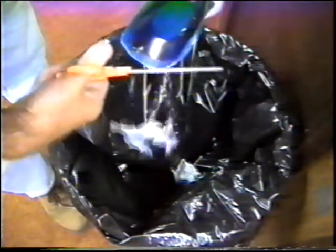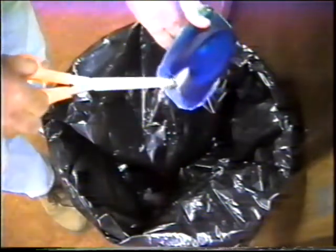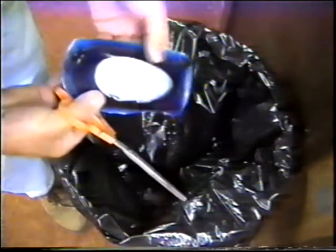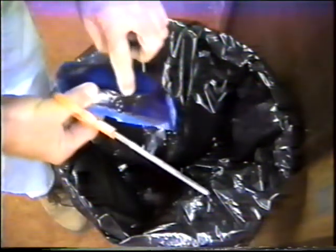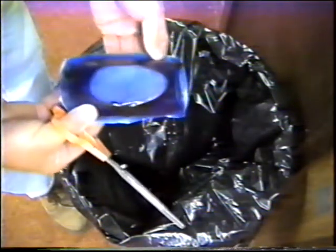Now this is the original one we molded up, our original test. I'm going to cut most of the rough edges away, so I want to sand this down. I want to just grind down these little patches that we made. That's where there's an air bubble, and again, being able to patch it is a critical part of making a mold. You've got to be able to do a little patch like that. And then I'll pull that other one out and see if we have any air bubbles in that one. I'll patch them up too.